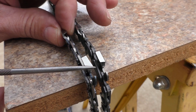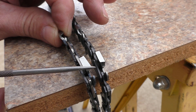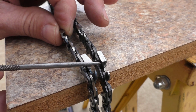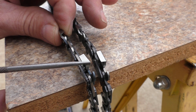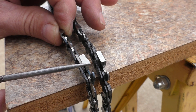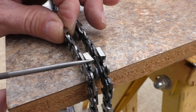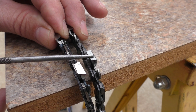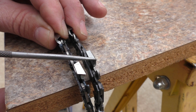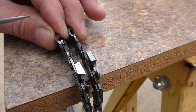With a chisel chain that has such an aggressive angle, the tooth is going to want to lift up in the wood when it cuts and also lean out — there's enough play in the chain that it can do that while cutting. This point is about the only thing that really does the cutting, and it tends to dig into the wood in both depth and to the side, giving you a rough cut. The ripping chain, with its less aggressive angle and rounded tooth, has less tendency to dig outward, so you get a smoother cut.